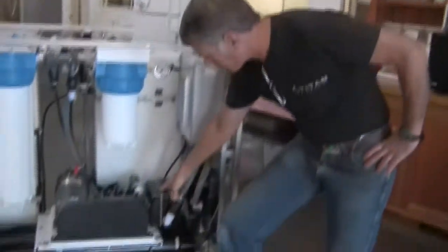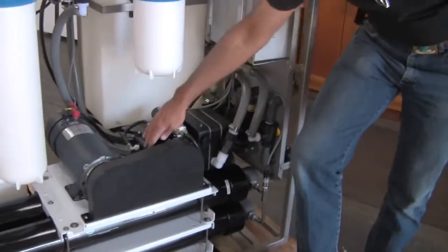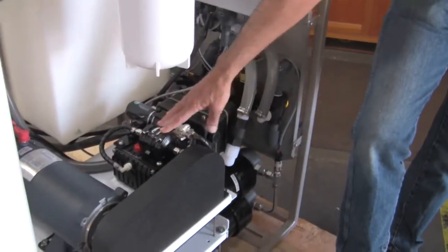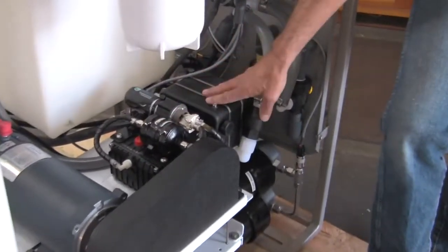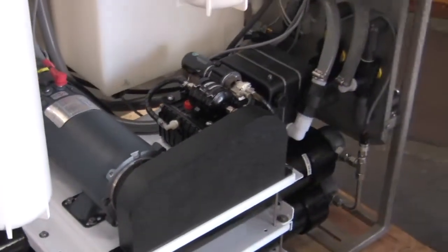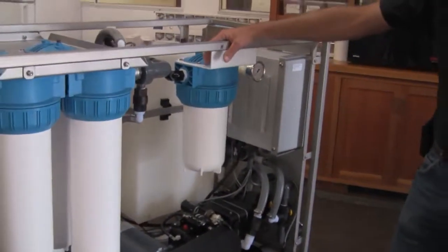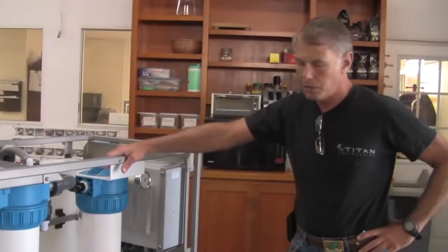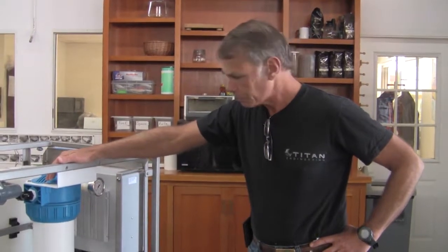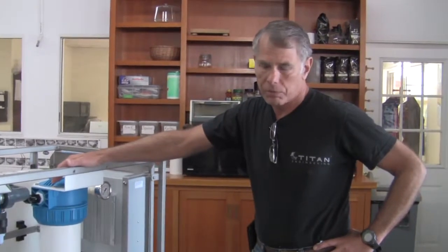This is the Pearson pump here — it's the heart of our system. It has a standard crankcase type reciprocating mechanism. You can see there's an oil filtration system, and this pump is belt-driven by a DC motor. This system is designed for solar applications, so this is a 48 volt DC unit. We also built this in 24 volt DC, and we have 110 and 220 volt versions available as well.